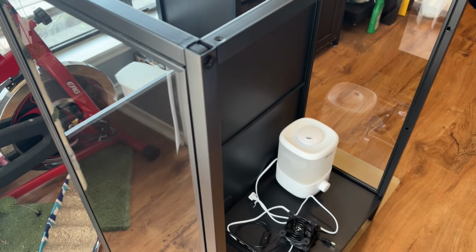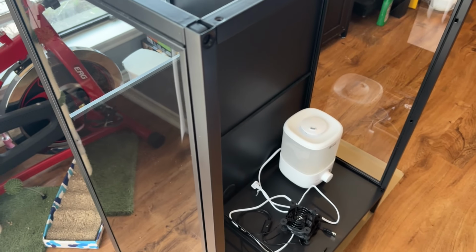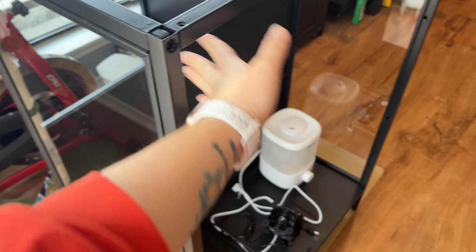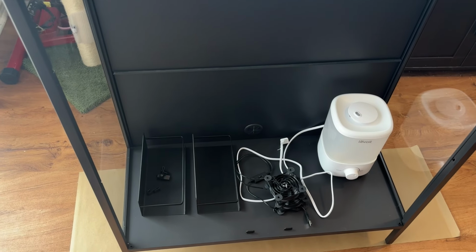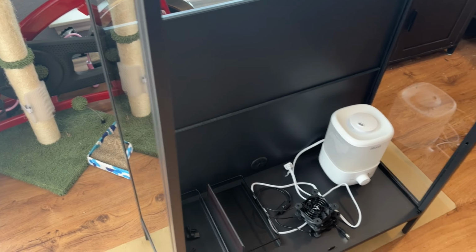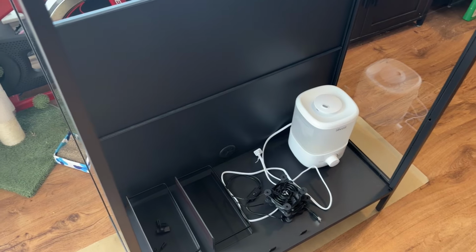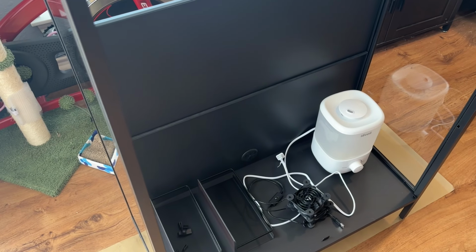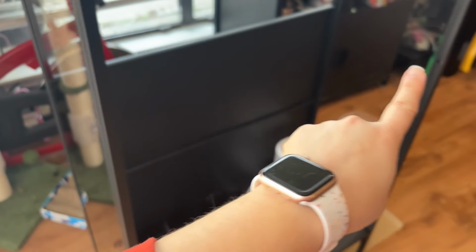As we're doing the weather stripping, which is, yay, the last big time-consuming modification on the plant cabinet. I don't have the doors in yet, so let's get your perspective. This is the front. None of that stuff is set up, it's just storage. But we're adding the weather stripping, and I wanted to show you, if you choose to use the weather stripping that I have listed, which is 8 millimeters wide by 3 millimeters tall or deep, what happened on the side glass panels.